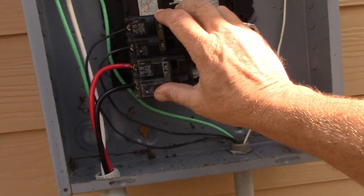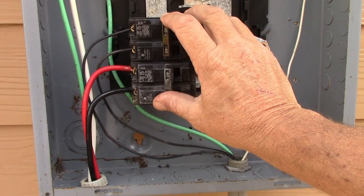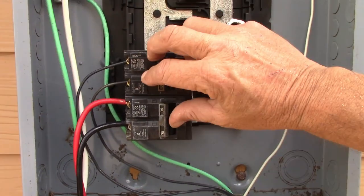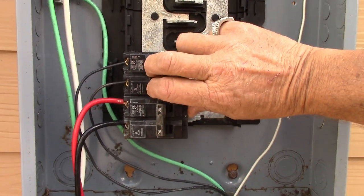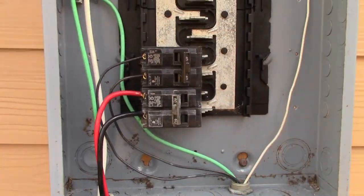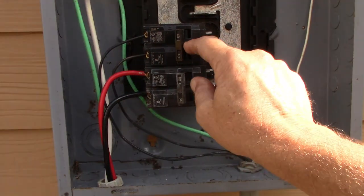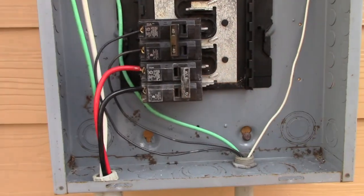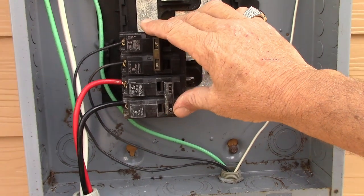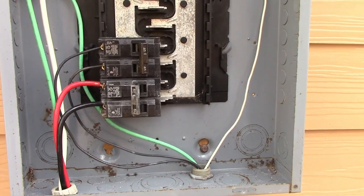The interlock connects to these two breakers. Before you do this, make sure you can get the interlock from the manufacturer. A lot of them make interlocks from the main breaker to a branch breaker, but not branch to branch. Cutler Hammer makes a really neat one — as you turn one off, the other automatically turns on, and vice versa. Under normal conditions, when you're just using regular power, this generator breaker is always off and the feeder breaker is always on, feeding whatever circuits you've transferred into the transfer panel.